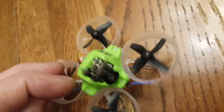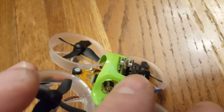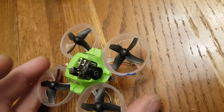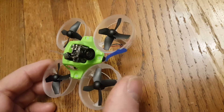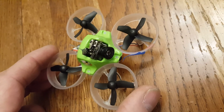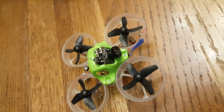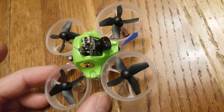I glued the camera and also glued strain relief on the antenna and on the receiver antenna. Tape is just holding the wire down while the glue dries. Flew it like this — four and a half minutes with a 210 milliamp hour pack; that would probably be over five minutes on a 250 pack. Use a timer — I set mine at three minutes so I get plenty of reserve and don't have to rush back. Hope you liked the video, thanks for watching.